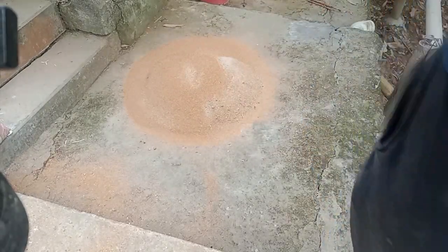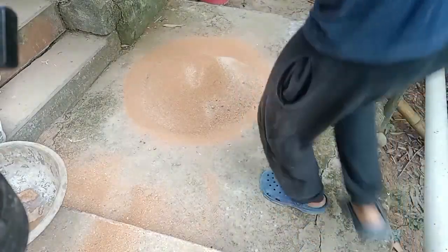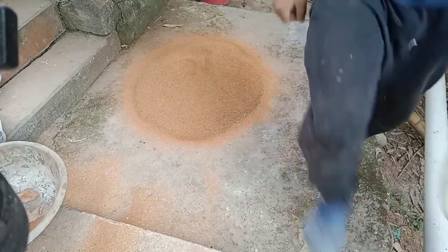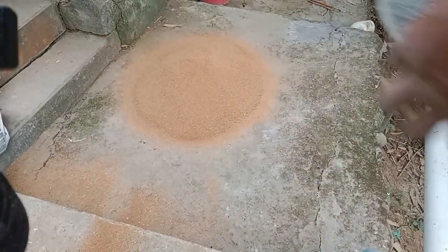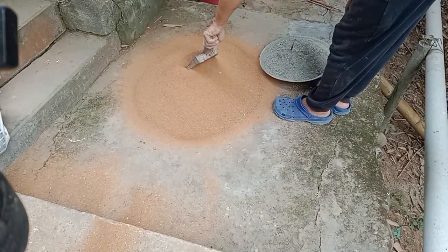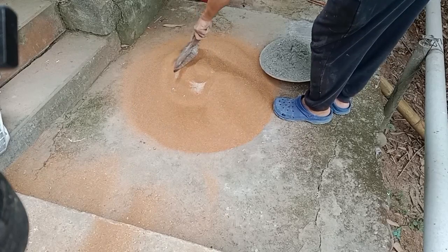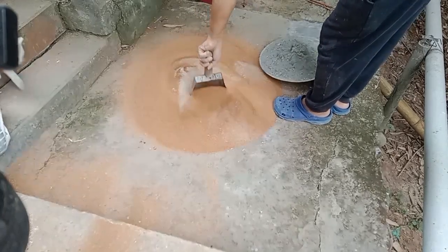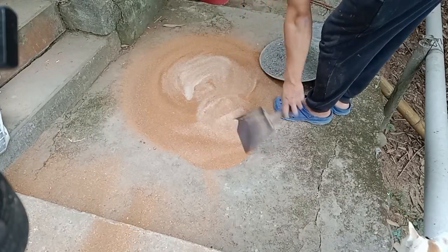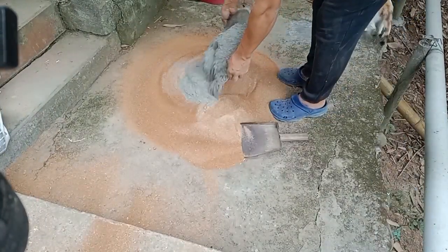Here, I want to highlight that there are different ways to mix depending on the masonry work that needs to be done. And also it depends on the worker, what ratio they wanted. It could be 1 to 5 for a more economic purpose, or it could be 1 to 3 if you wanted to have a stronger bond.